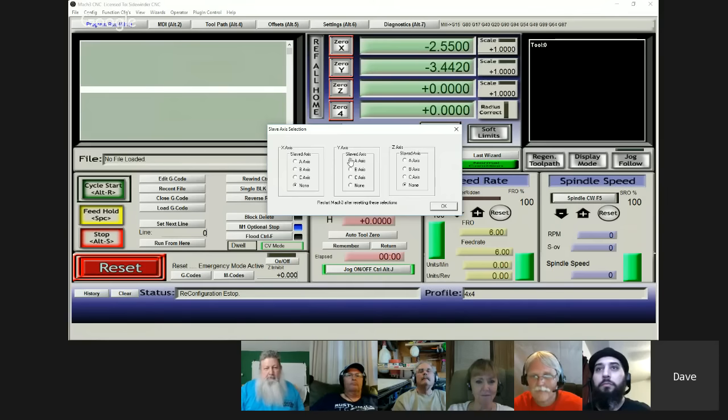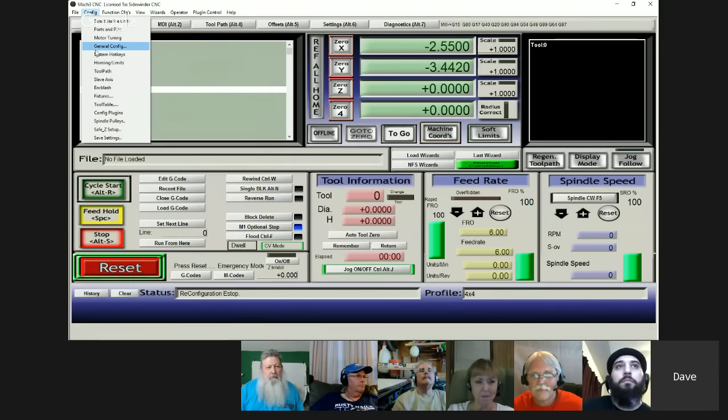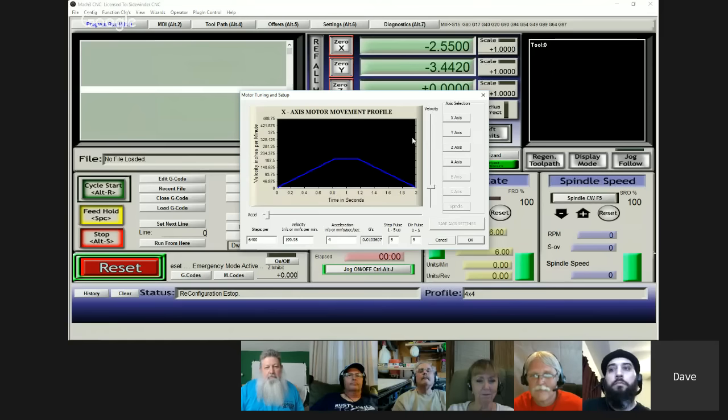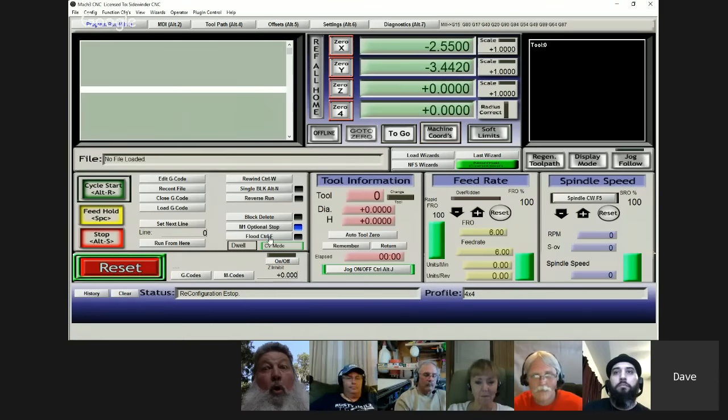Yeah, right there. Okay, and also now that you can see all this stuff, I'll go back and show you the other thing that I was talking about, when you do your motor tuning. Here you can see I've got 6,400 steps per unit on my X, Y, and my Z, and you'll notice on my A, that's still the default settings that was in Mach 3 when I first installed it, and I don't really have to work on it. You could put something in there, but it doesn't really matter. It's picking up all its information. Since I told it to slave with the Y, it's reading those numbers, so you don't really have to set it up. Doesn't hurt anything if you do. It just doesn't use that. Okay? There you go.